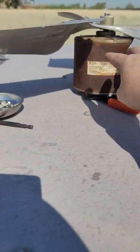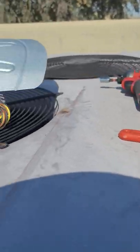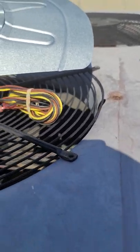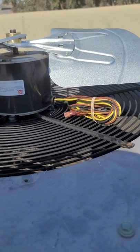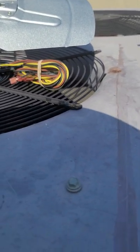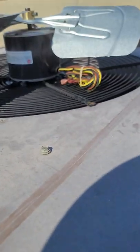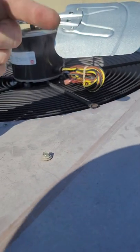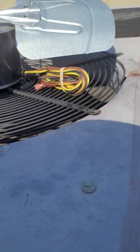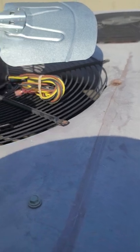The reason why you want to put the blade at the same depth on the shaft is because when you flip it over and it spins inside the AC housing, it can hit the shroud. The shroud is the side of the AC right here. Just like in a car you've got that plastic fan shroud covering your fan for your radiator - it's the same. There's a shroud around here, so when you flip it, it spins inside of a shroud.